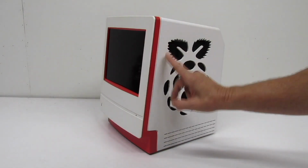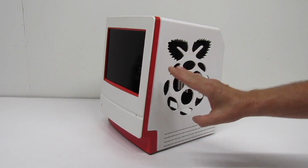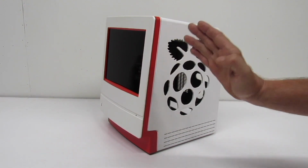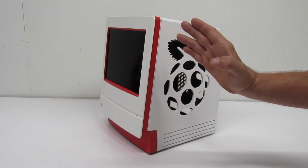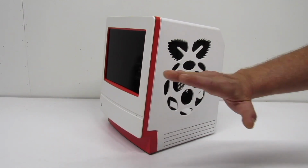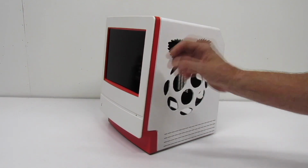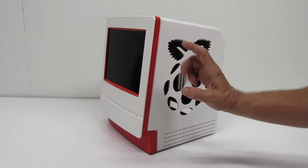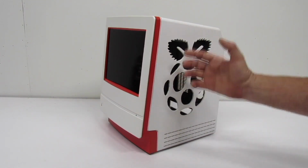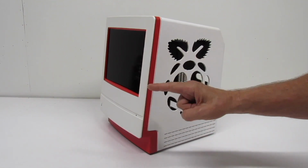Okay, here it is, and I have to say that this was the hardest part of the project, getting this painted. Before I do any painting, the night before, I look up the weather and make sure that it's not going to be windy and that it's going to be low humidity. And then I recheck it the next morning. Now, there was not supposed to be any wind. Visibility was great. It was a beautiful, clear day. And then out of nowhere, a gust from the east comes and sends this rolling about 5 meters, and it's covered with sand. So I had to go down and strip it, and I waited a couple days, and I made sure there was no wind, low humidity again.